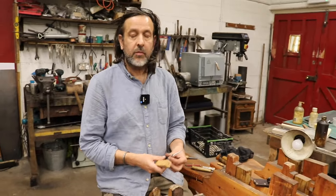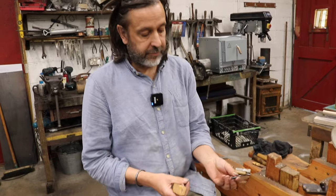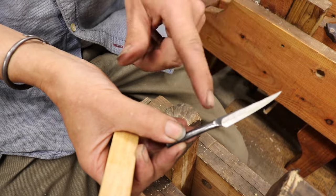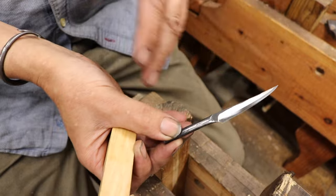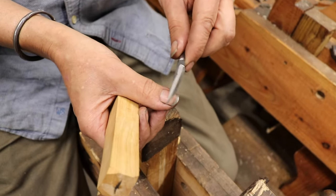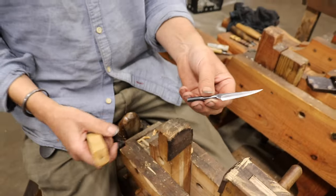Before we begin the handling process, can you give a brief recap of what we've done in previous videos? We started with round bar of quarter-inch section, forged it out — you can see the remains of the forged section here — then profiled it, heat treated it so it will cut like a knife, ground the bevels, and we're very close to a finished edge. It's sharp but not dead sharp yet; it still needs a little work, but it's better to do that at a later stage.